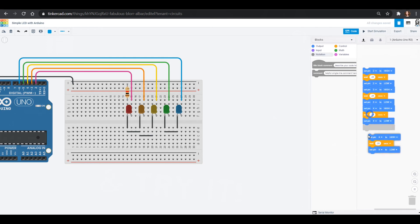We can just keep duplicating this set of three blocks and changing it to one number up. So now my program says: set pin two high — that's red — wait a quarter second, set red low; at the same time set orange high, wait a quarter second, set orange low and set yellow high. And I go through this all the way down — once it gets to the bottom it always comes back to the top. Arduino programming goes in an automatic loop, so you're always going to go back to the top.